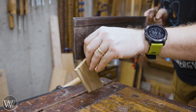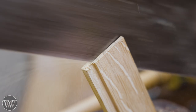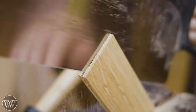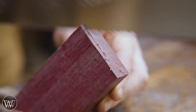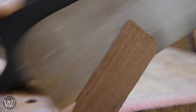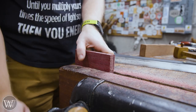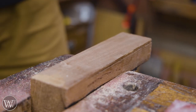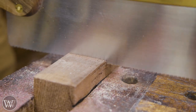I'm actually going to be doing something fun here with a couple different pieces. I have three different colors of wood that I'm going to be sandwiching together and then planing them on angles so you can see all three of them. But this means you have to saw down thin material, and usually I'll saw it down to about an eighth inch. That way I have one side that is planed perfectly smooth and then the other side will be rough from the saw. The smooth side you can glue to others, but what happens if you need a smooth side on both? That's why I wanted to do three of these so that I have two smooth sides on the outside pieces glued to the two smooth sides of the inside piece.